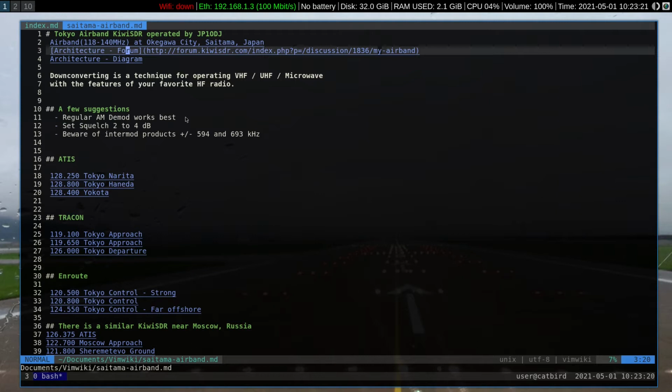The problem with using the Synchronous detector on the air traffic frequencies is that the different stations are not accurately zero beat on one frequency. You will see, if you look closely, that the controllers are on one frequency, the aircraft are above and below, and they are generally not dead on, and it's difficult for the Synchronous demodulator to track and lock onto those different carriers. As soon as one station drops carrier, another one comes on a slightly different frequency, and it takes time for the Synchronous detector to get that internal carrier in phase with the station that's being received.